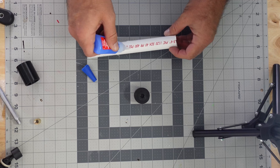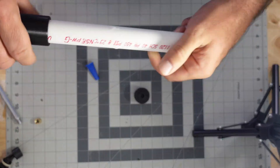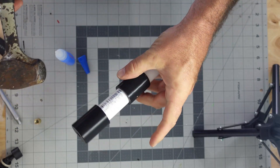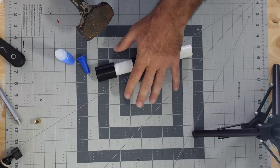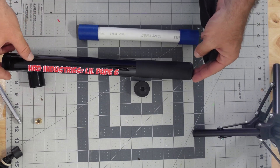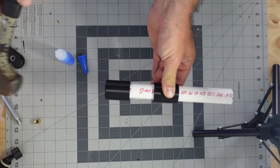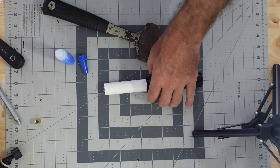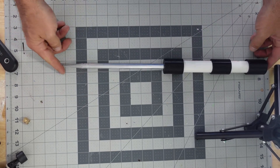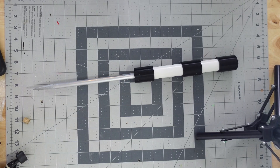If you want a really good surface for the superglue to adhere to, go ahead and sand down a little bit of the PVC — this will give some texture for the superglue to grip. Then put the superglue on the PVC, being very mindful of where your hands are positioned; I superglued my hands together multiple times. When I got that two-foot piece of PVC, I cut it into thirds — eight inches for each piece. I have tested this with about 11 inches of PVC and it works just fine; I was just trying to conserve space. Here you see me applying the cap to the PVC — when I cut the PVC I didn't use the right tool, so it was a very dirty cut.